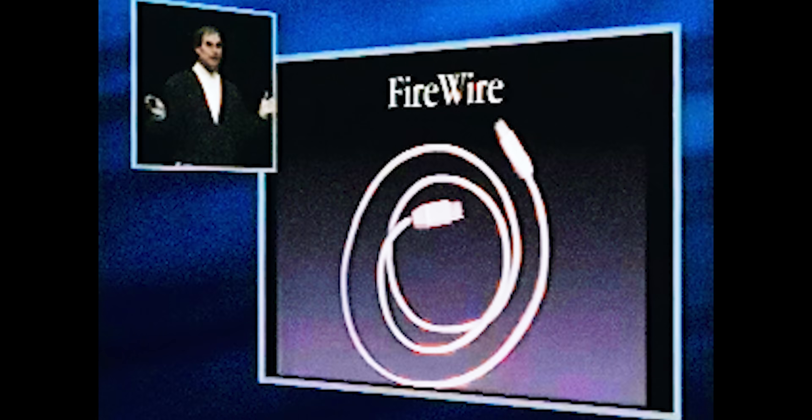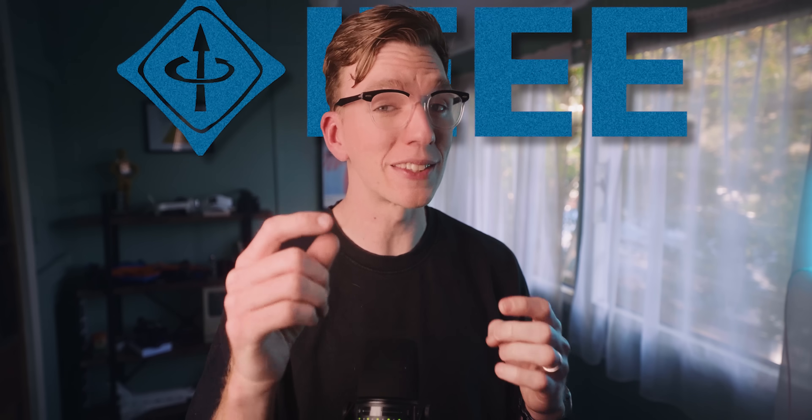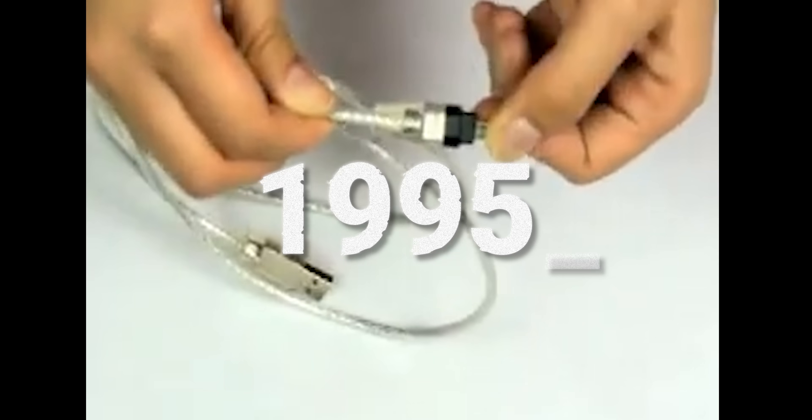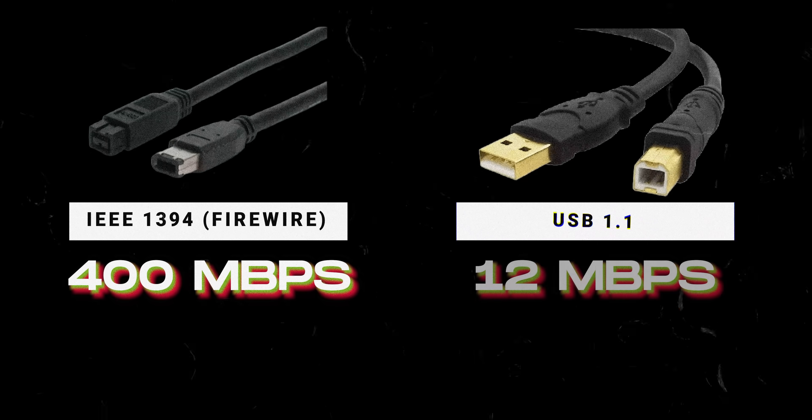Not to mention the problems they had with longer cables. PC manufacturers were skeptical about the cost and complexity. Sony and Intel were interested but watched from the sidelines. So Apple made a decision that would either make or break everything — they officially rolled out Firewire as part of their product line on the motherboard of every new Power Mac G3. Instead of keeping it proprietary like every other Apple technology, they submitted it to IEEE as an open standard. IEEE 1394 launched in 1995, supporting 400 megabits per second, when USB 1.1 was crawling at 12. It wasn't even a competition.